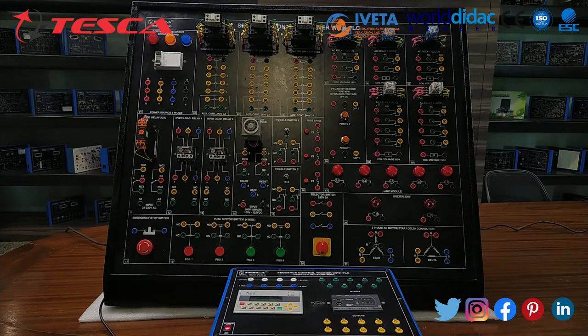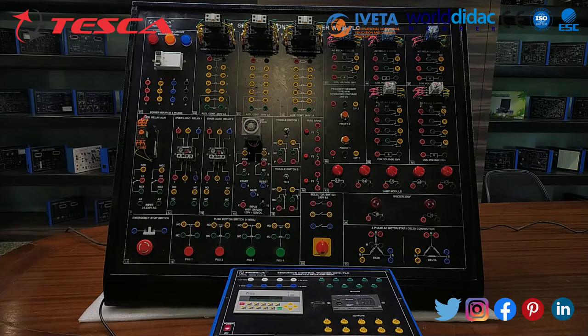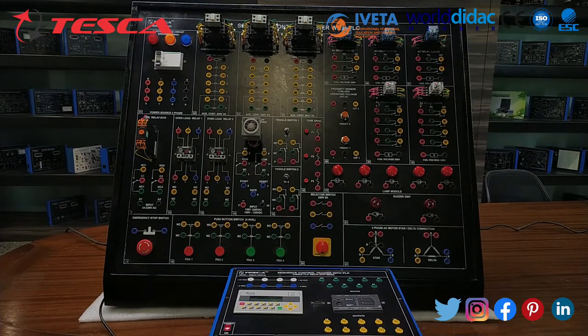In this, we have taken 5 products indicated by the lamps L1, L2, L3, L4 and L5. As a product passes the sensor, lamp 1 is on, and the process follows till lamp 5. After lamp 5 turns on, the buzzer sounds, and it means the packing of the product is started. And when we give a signal to proximity 2, then the second conveyor starts and hence the process is completed. So this is our logic for using the proximity sensor. So let's see it on the panel.